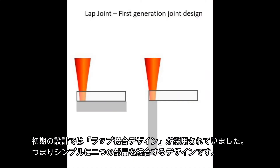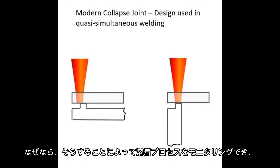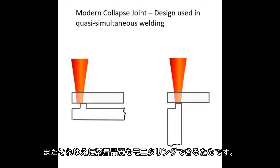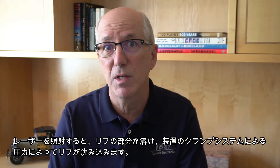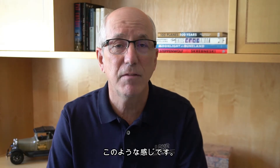Let's look at the basic design rules. Early designs used a lap joint design, which is a simple overlap of parts. Today, we favor the modern welding rib design because it allows for process monitoring and monitoring of the welding process, and therefore the quality of the weld that you can't get with a lap joint design. The welding rib is simply a narrowing of the wall within the top millimeter or two of the housing. When irradiated with the laser, the rib melts and collapses under the load of the clamping system.